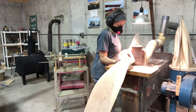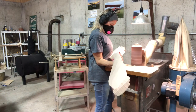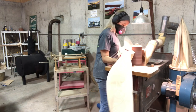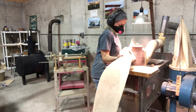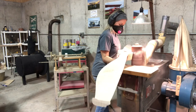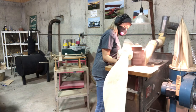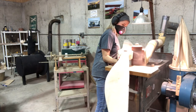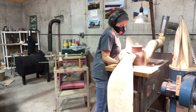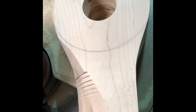These three-inch thick hubs are probably my favorite to do. They're a lot easier than the two-and-a-quarter or inch-and-a-half thick hubs. They're heavier, but they're so much easier to transition because I have so much more material to work with. Same thing when it comes to balancing — I enjoy balancing these thicker props more because I do have so much more material to work with.